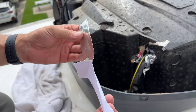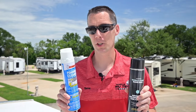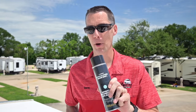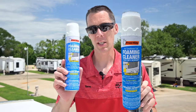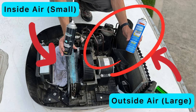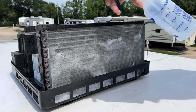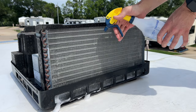You'll need a little bit of foil tape to replace spots you peel off when taking things apart inside the air conditioner. There are two types of foam I use. The first is the Dometic brand antimicrobial air conditioner cleaner — I use this mainly on the inside air coil. The second is an air conditioner coil cleaner with a little brush on top to clean dirt and debris out of the coils and straighten fins. I use this only on the outside air coils. Both are no-rinse cleaners, but I use a spray bottle with a little water to rinse down extra dirt and debris and clean up the bottom of the coils so things flow out of the air conditioner and not into the RV.